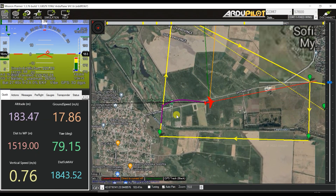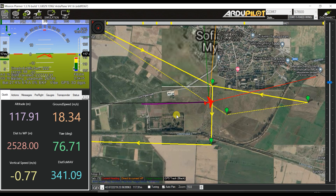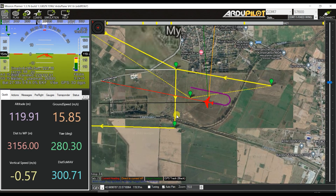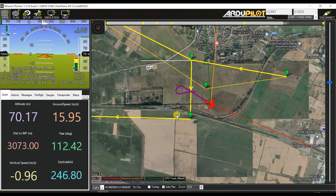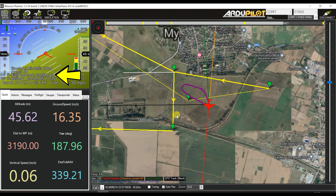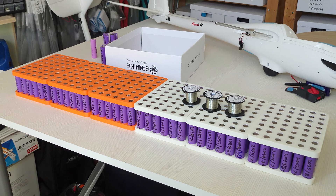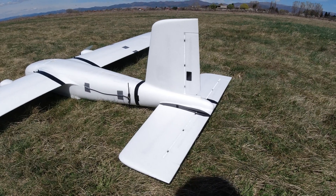Because of the Dragonlink system I had telemetry working on my laptop and I could see what was happening. At some point I noticed that the ESCs were starting to cut off power to the motors due to what they considered a low voltage battery — sadly those ESCs could not be programmed to any lower voltage level, but in any case this was low enough to also protect the battery. The whole flight lasted 3 hours and 46 minutes, in which time the Fighter covered 232 kilometers, which is now also the longest range and endurance plane that I own. I should have anticipated that though with a battery of almost 1kWh of capacity — that is half of the capacity of my solar system battery in my workshop, and that one is a lot bigger and heavier. Pretty impressive plane that one turned out to be.